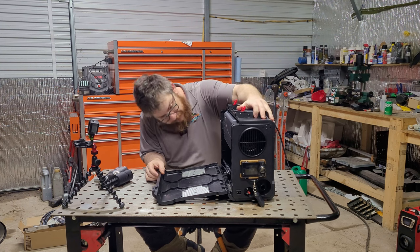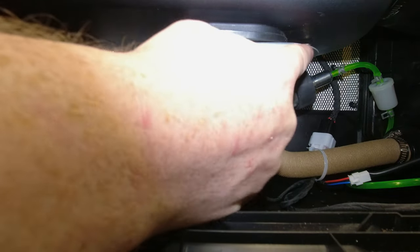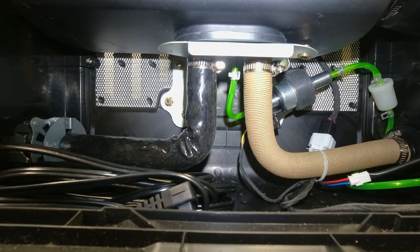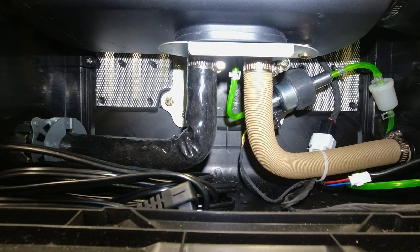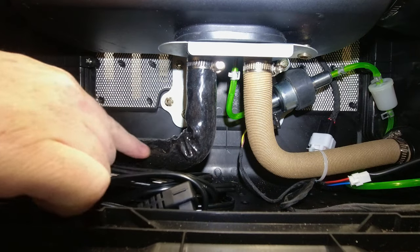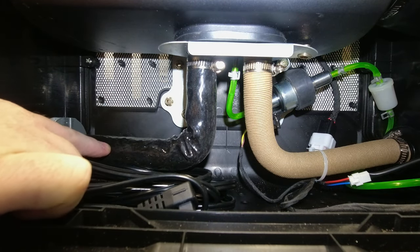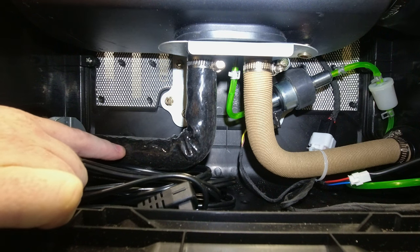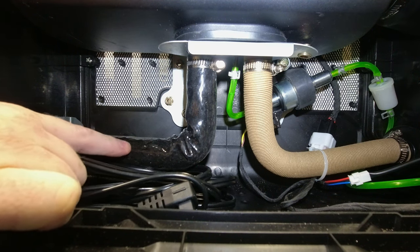On the inside, the fuel pump is normally mounted here and it's basically horizontal, which isn't ideal. So I am utilizing one of the spare mounting locations for the fuel tank to mount the fuel pump so that it can be more at an angle. I have already upgraded the insulation around the exhaust pipe on the inside — this is a fiberglass coated in silicone.